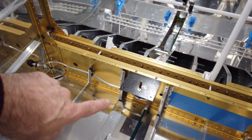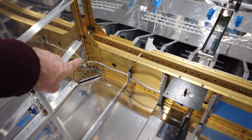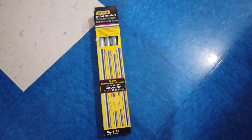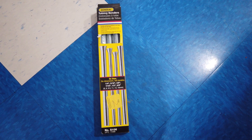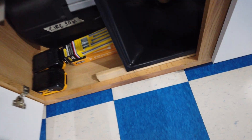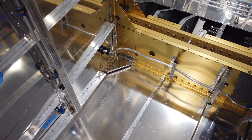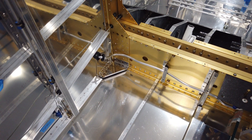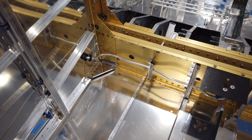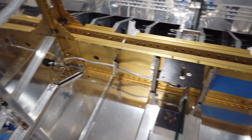I had the line in and I needed to do the S-curve right here — that was the last thing I needed to do. I bought the spring-type tubing benders; these are springs you slide over the tubing and bend by hand to prevent kinking. But personally I don't like them — they weren't working for me. So I pulled the line out, and this was my third attempt. It's not perfect but it's in, it's not kinked, and it works.